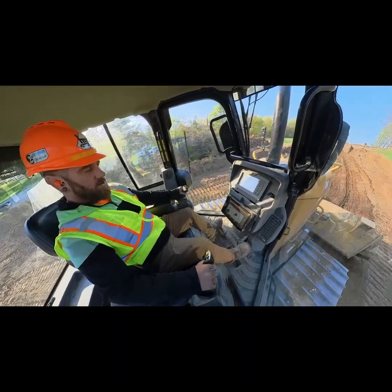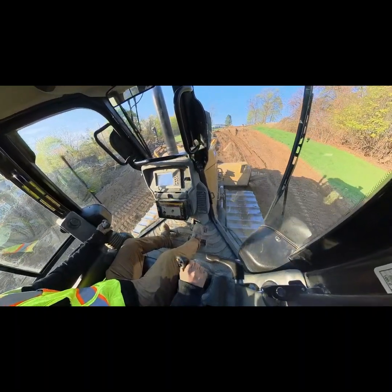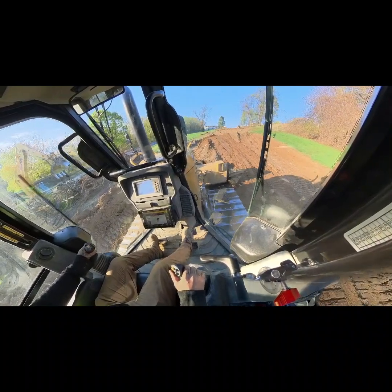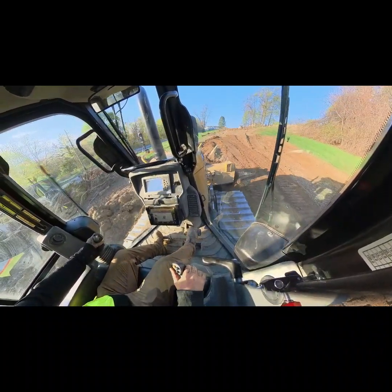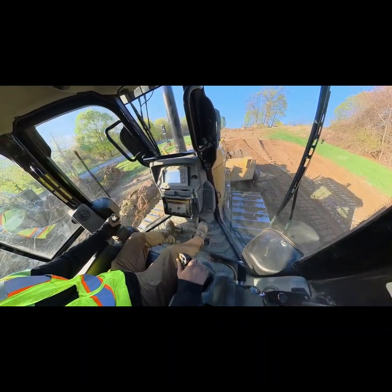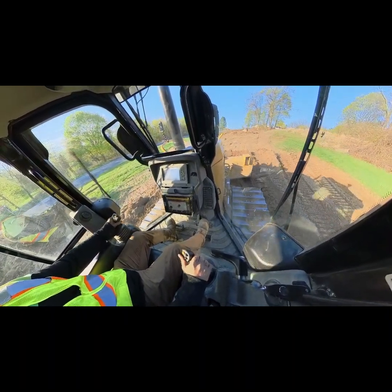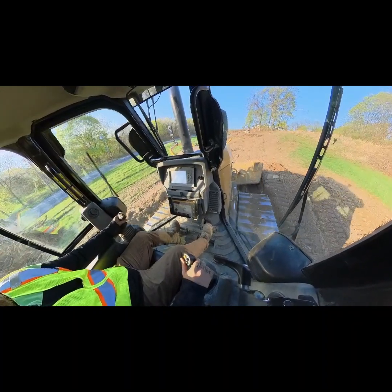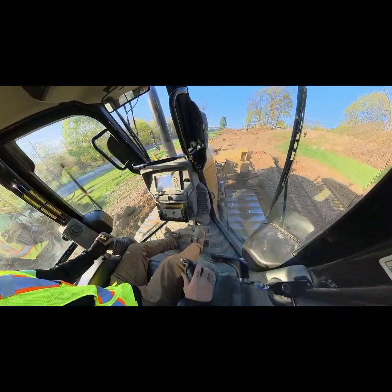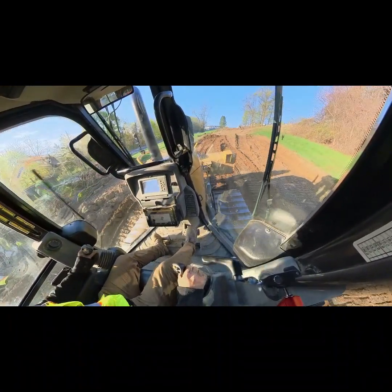Subgrade where we're gonna have a sewer lateral running. So we're gonna get subgrade and we're gonna windrow all our material off to one side here as a water trapper. And essentially we're just gonna keep working alongside of this cut here and get subgrade, windrowing it all up here to the left side so the excavator can track down through here nice and square and dig this sewer.